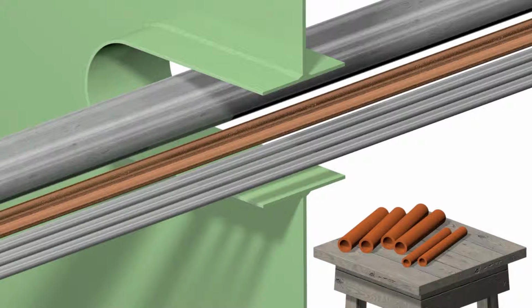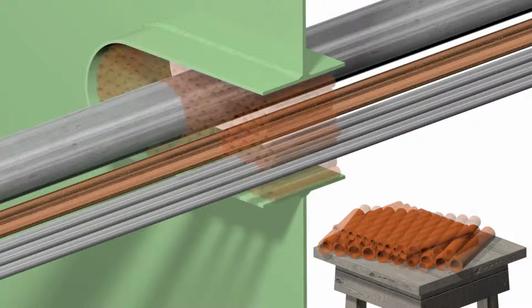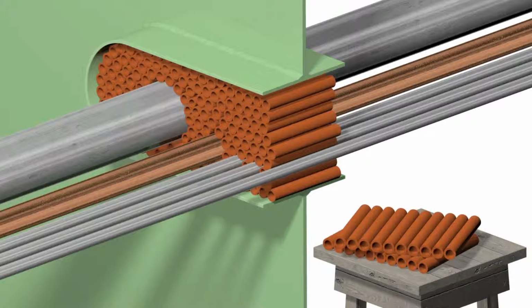However, for better mechanical stability and especially for watertight penetrations, it is advisable to lower this ratio to 1:1. NOFIRNO filler sleeves are available as single sleeves, but the installation is easier and quicker with multi-bundles of 10 sleeves. To prevent any mistakes with the filling ratio, NOFIRNO multi-filler sleeves type 2215 can also be used as shown.